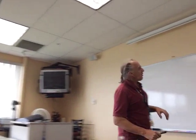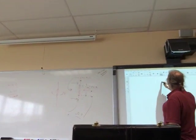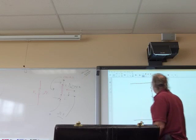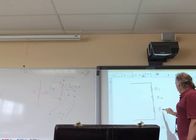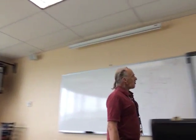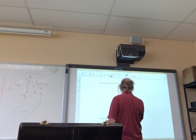Voltages. So I may build myself what's called a voltage divider. Now, a voltage divider is simply a device. It's actually a network of resistors that allows me to pick off certain voltages off of my supply. The actual resistors make up a series resistor network in this case, and at certain points, which we already know because we finished doing some of that, I will have certain voltages.